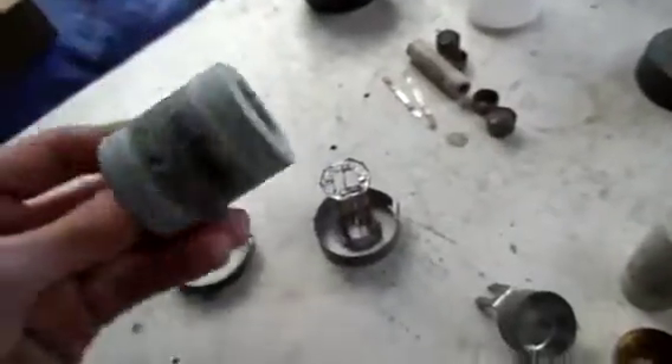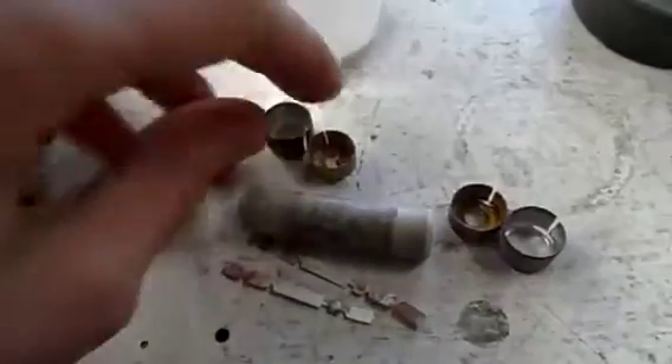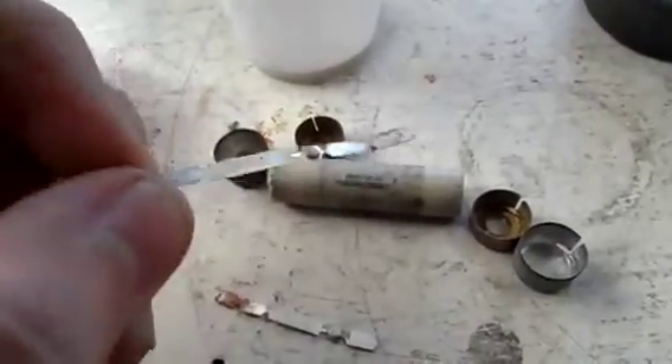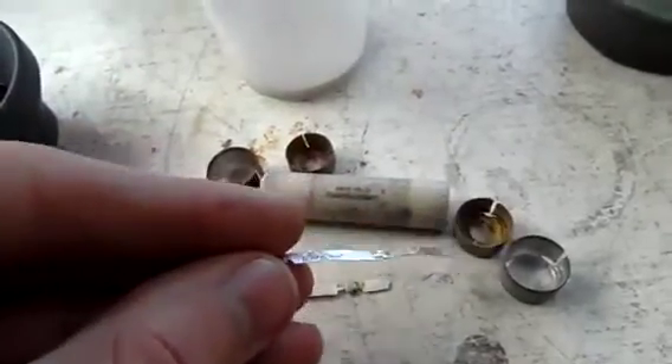I used the grinder to cut out the casing just so I can show you what it all looks like. Over here we've got a much smaller 55-amp Bovara. In fact all the Bovara fuses are pretty poor quality because they don't put proper gaskets in them — sitting in a bucket full of water has given them rusty caps and they've leaked, filling them with moisture, which renders them useless for experiments or resale. Same internal deal though — two straps of about 27 amps each, soldered to the inner end caps.